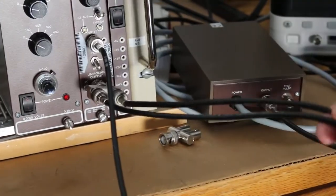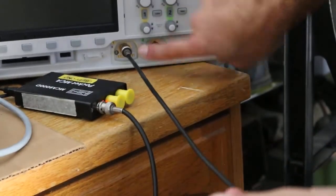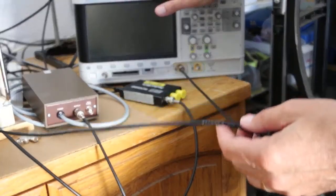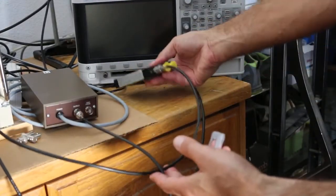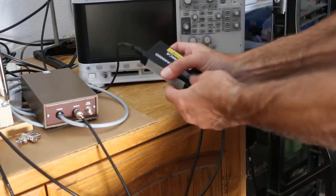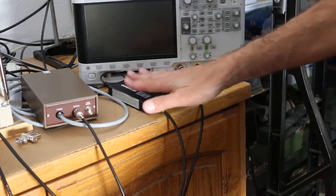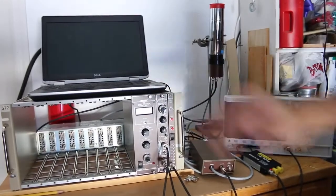And at this point, we're sending the amplified signal into two places. The first one, on this cable right here, is over to the good old trusty oscilloscope, because we're always interested in verifying the signals are working, so we just want to look at what's coming out of the amplifier. And the second place the amplified signal is sent, as you can tell right here, is into this little black box that sits in front of the amplifier. This is the data acquisition box. This is the one that takes the data. You can see on the other side is actually a USB cable, a consumer level cable here. This takes that voltage and gets it routed properly into the computer for data acquisition.